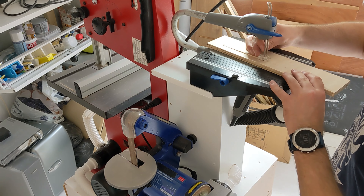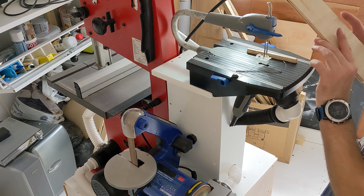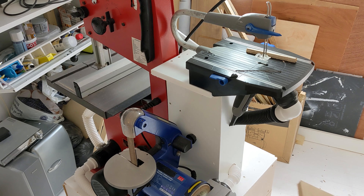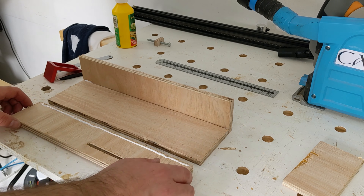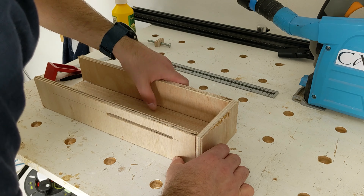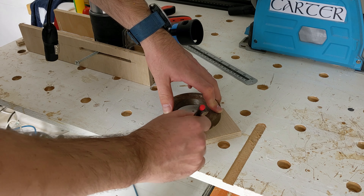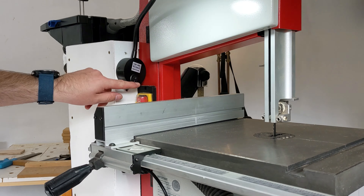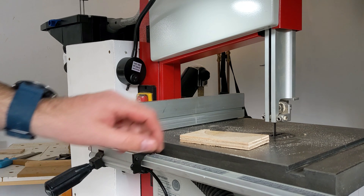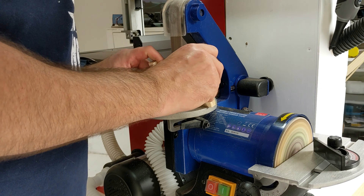I'm working on the first job of the jig. To get the repeatability of the groove, I've marked out the side of the jig, drilled two holes, and used the scroll saw to cut out the channel. This channel keeps the router in the right place and provides positive stops on either end of the workpiece. I can use some glue to fix the two sides of the jig to the base. To allow dust collection with the router, I've marked out and cut a curve on the end using the band saw, then used the one-inch belt sander to tidy up the edges.